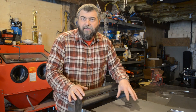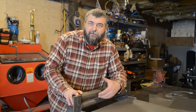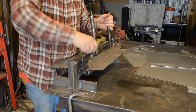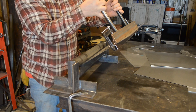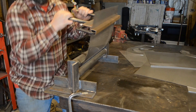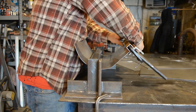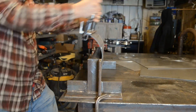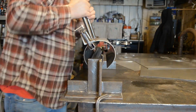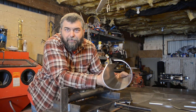This is the tool that I built to bend these pieces of 304 stainless into a cone shape. If you want to see how I put this together, there's a link in the description for the build video. So first we'll load our sheet, clamp down the handles, line it up, and just start bending in little increments until we get it all the way around. After a couple of minutes we've got a tubular-ish shape — close enough.